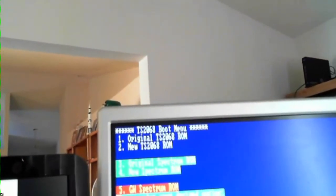Okay, and then also in there, I've included an 80 column display. There's enough memory in the FPGA so that I can maintain the Timex display as well as an 80 column display. Basically what I've done is some modifications to Grant Searle's terminal that he uses for his Multicomp. Essentially this will take a subset of VT100 codes and allow you to output 80 column video. I've also included a TMS9918 video display processor as part of the FPGA. I haven't done anything with it yet, but I know that it works because I've used it in another project over the last couple of months. So that's where the video project is sitting right now.